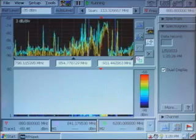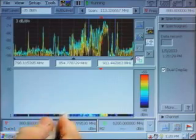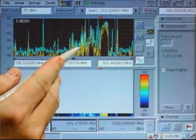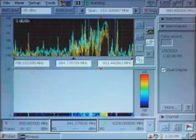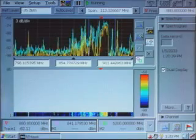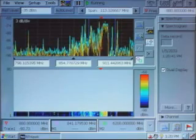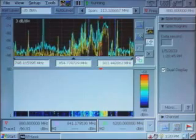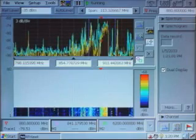You can see the max hold buildups resetting every 3 seconds as well in the upper display. So now, for 3 seconds, the spectrogram is collecting data at the full speed update rate and storing that data in a max hold waveform. At the end of 3 seconds, it starts over, collecting a new max hold waveform again at the full data rate.